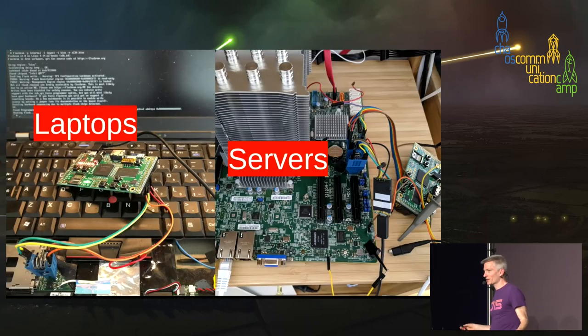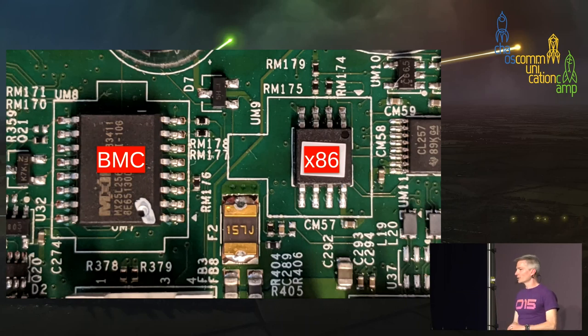It's a huge pile of hacks, but it all works. We can boot quite a few laptops and servers, and on pretty much every system we've tried, we've found interesting TOCTOU vulnerabilities. We've also been able to accelerate firmware development for groups using these machines. One area for future research is supporting other architectures — for instance, on that server there's another SPI flash storing the ARM BMC (board management controller) firmware. More information is available in my CCC talk from last year about SuperMicro BMC hacks.